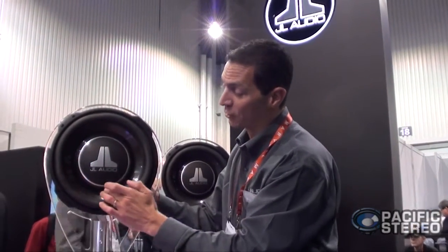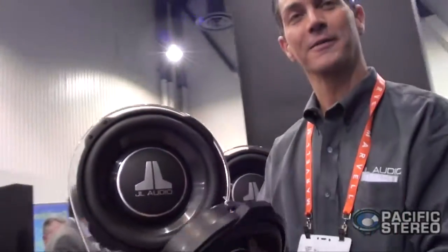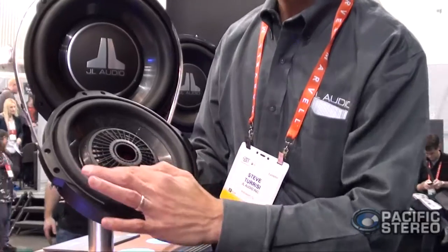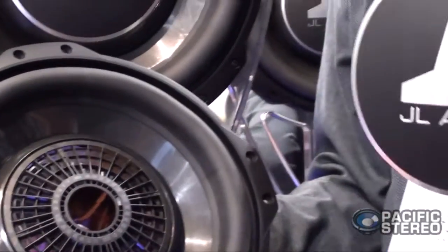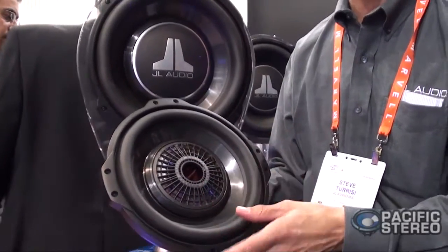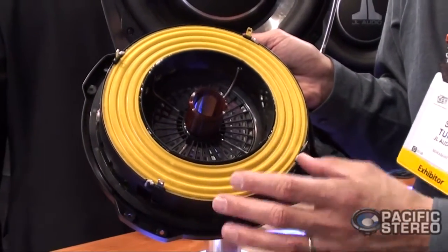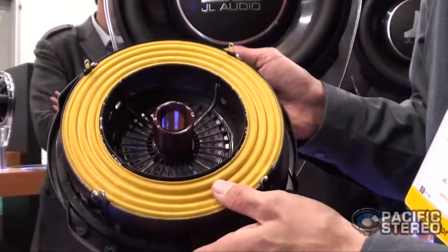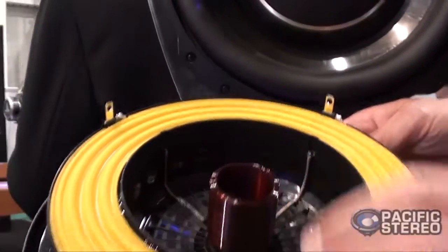The benefit to you as a consumer is much greater output potential without the risk of things rubbing. From the front of the speaker it looks pretty normal — it has a very large aluminum dust cap, and if you look at the very edge there's a plastic part as well. The two parts are separate. Underneath the aluminum dust cap you'll see a very intricate series of channels and holes that help flow air through the entire center of the speaker. The aluminum material is chosen to act as a heat sink to improve heat dissipation of the voice coil. On the back side you can see a very substantial coil with multiple layers, the four connections for the dual voice coil option, and additional holes on the inside edge for even better venting.